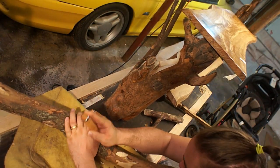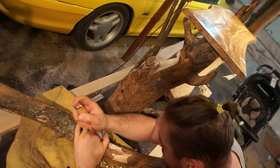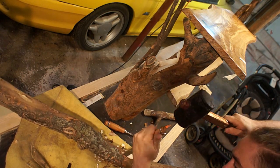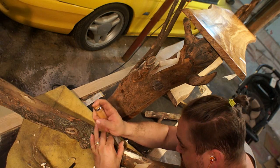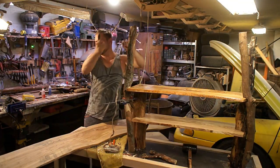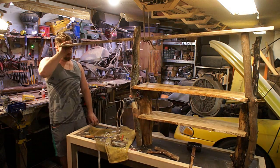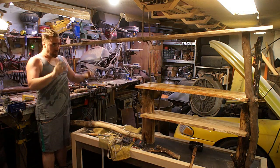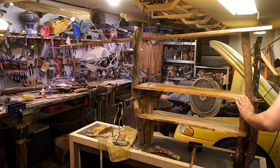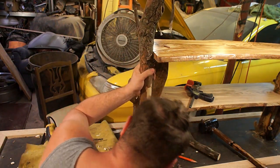I gave everything overnight to dry so it was good and solid before working on it again. This middle board is going to go all the way up through to the top and I'm going to anchor it into all three shelves. What I'm carving right now is a little relief so the branch that's jutting out also ties into this upright — there's only going to be one in the middle so I wanted it to be really strong and solid. This is a really long section, at least 5 feet, so I had to figure out how to suspend it so I could eyeball exactly where all the cuts would go into all the uprights and where I wanted it to sit on the shelf. All the uprights end up being at different levels so I tied it to the rafter up top to suspend it while I adjusted its angle to hit that top shelf the right way.